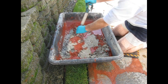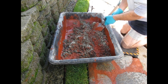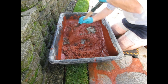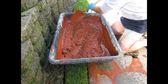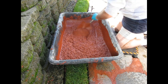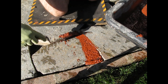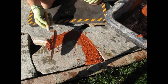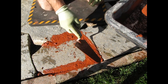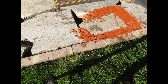Now, mix the water into the concrete. Slowly mix in more water until you get the concrete to the correct consistency for spreading with a trowel. Fill all of the gaps between the stones. Work the concrete a little bit to get it into the cracks, but not so much that all the large aggregate inside the concrete would sink to the bottom.